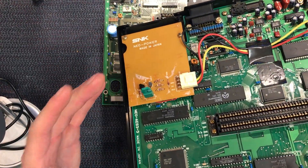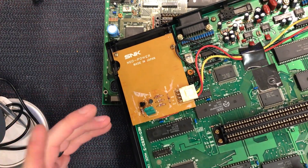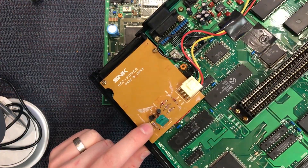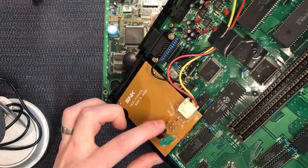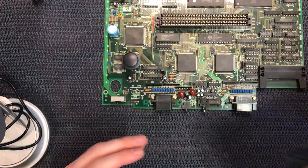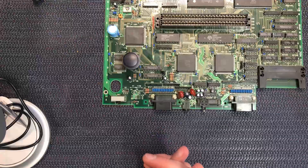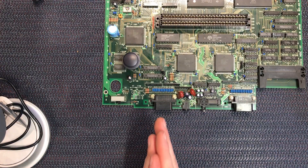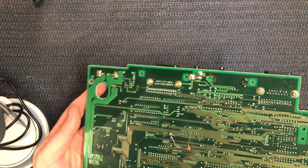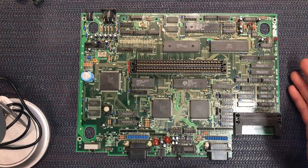I've gone ahead and done that. I'll post a link to all these components in the description. The half watt is just physically a bit larger and can dissipate more heat, and the quarter watts are a bit smaller. Luckily I had that reference board - that's going to get me out of trouble. I've ordered the parts, going to wait for them to arrive and fit them up. But right now let's take another quick look at the board, see what's actually going on, and if there's any damage we can repair while we're here.